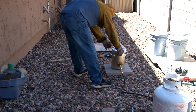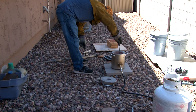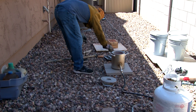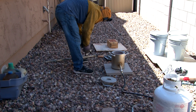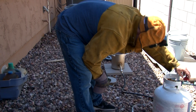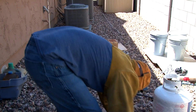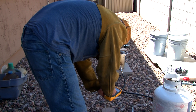The aluminum I'm putting in is a mixture of car parts that have been cast before because they have a high silicon content and cast very well — that's why they're used for car parts. I'm also using aluminum hard drives. The hard drive chassis were cast and then machined a little bit, and those work really well too. Usually I have a mixture of those going at the same time, and it seems to work well for me.